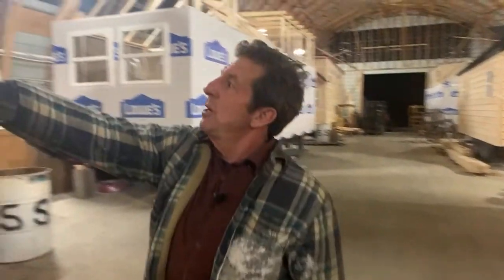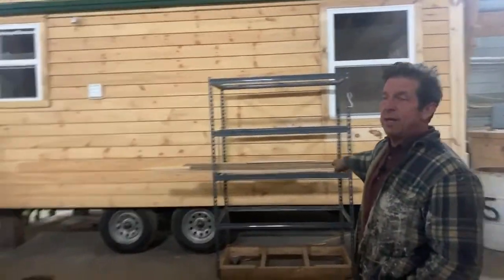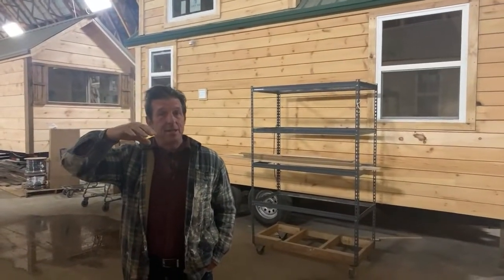Let's say you want to stucco this wall. You measure from that end to that end. Let's say it's 20, and it's 8 foot tall. So 20 times 8, 2 times 8 is 16, so it's 160 square feet.